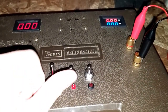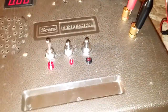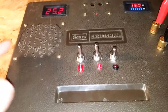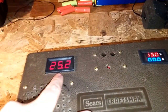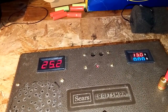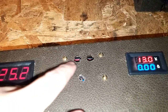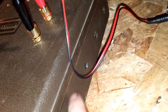This middle switch here turns it all on. The fan I have to dial down to about 5 volts because it's way too loud. This switch turns the motherboard power supply on, and right now we have an input voltage from the power supply of 25.2 volts — it's supposed to be a 24-volt output on the motherboard, but that's alright.